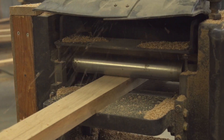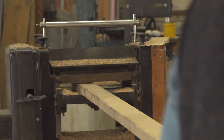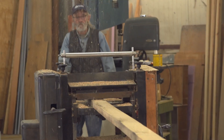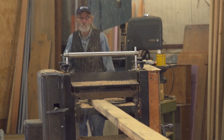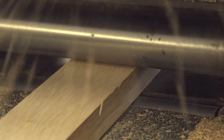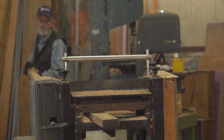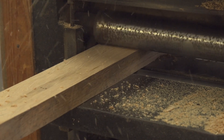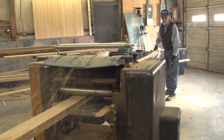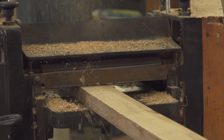When we bought these things, it was in a big slab and I ripped it up myself with a skill saw — really, really nice, no checks or any problems from one end to the other. I ran these pieces through the planer on edge. Once it was surfaced on both sides, I took it over to my table saw and clamped it down on edge and took my little Royal B electric planer, touched it up, and kept checking it for 90 degrees with a little sliding square. If the edge was not 90 degrees when I put it through the planer, it's just going to come out the same way — you can't eliminate that angle as you put it through. So we square it up, dub it up very well, and then put it through the planer with that 90 degree edge on the bottom, and it comes out perfect.